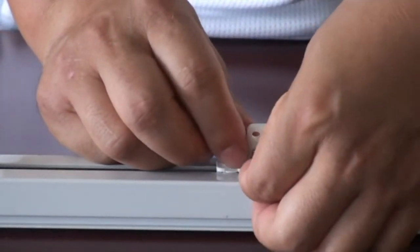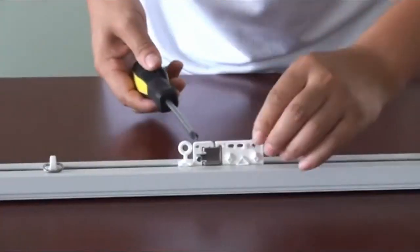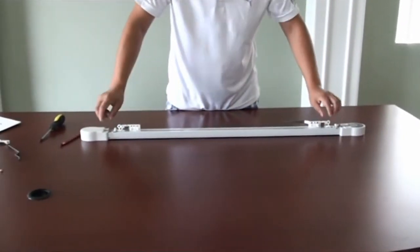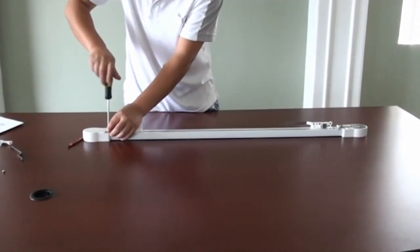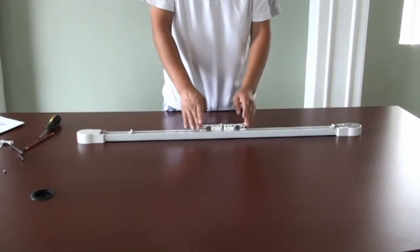Link the two master carrier parts together by a link plate and a screw and a nut. Use your hands to move the master carrier to the full length of the track and make sure that the movement is smooth. If the belt is too tight, loosen the loop stop and pull the drive unit out a little. You can also loosen the belt by repositioning the master carrier by 1 or 2 teeth.